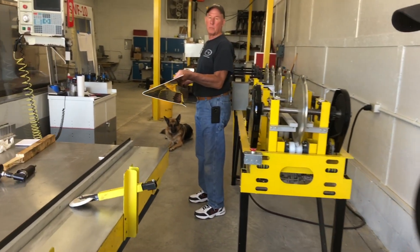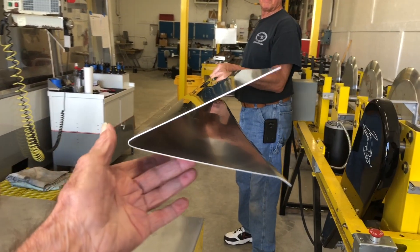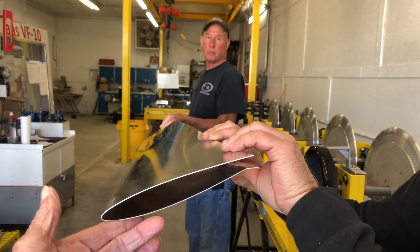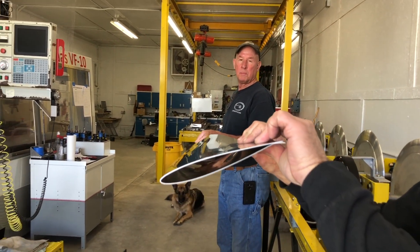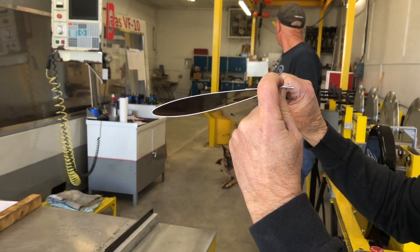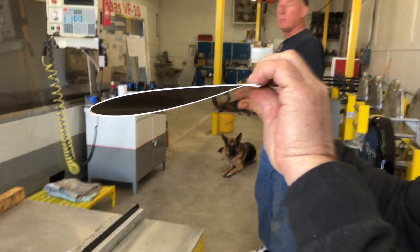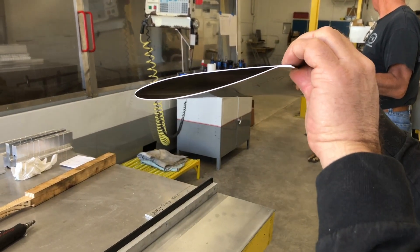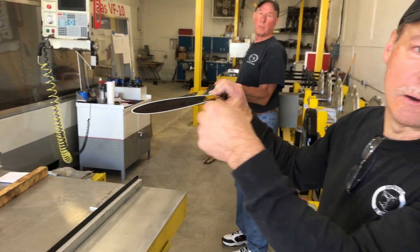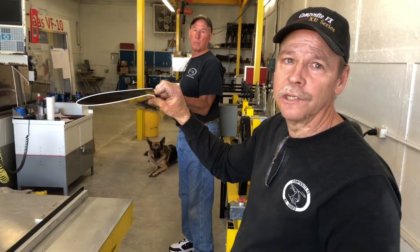As uneventful as that seems, it is really critical that the bend has to be bent exactly as much as it needs to be and exactly where it has to be. So it's a big process. This is what you get. In the mold, those two sides would come together — you can see the different radius. If you look at the very end here, this gap, once that gets closed completely, that pulls a little bit more in here as well. That's why you need the mold — it has to be at a specific spot and a specific angle, and then the mold can hold it into that shape.